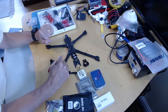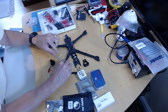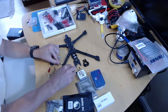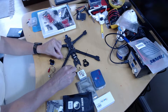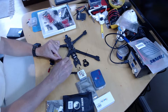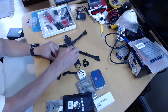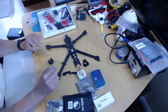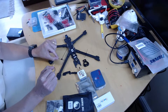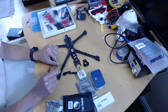Mounting them on top risks the props chopping them off — I've had that problem before. However, a slight flaw in my plan: these antennas are just too short for the arm length. So I'm going to mount them on the underside and run the cable through this hole to place the Tracer unit there. I've ordered extended versions with an extra five centimeters so they'll reach the Tracer module.